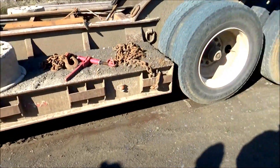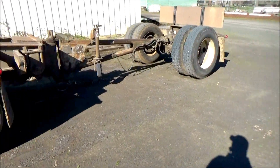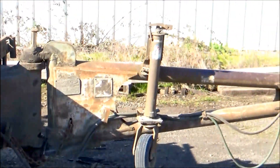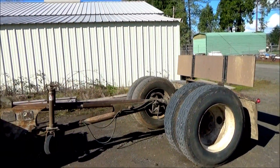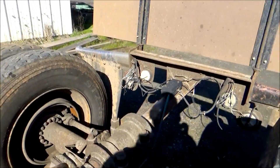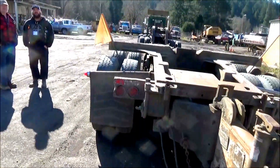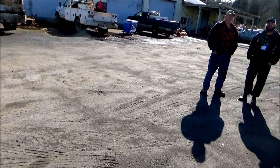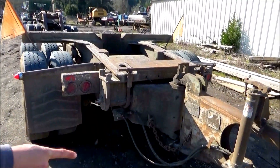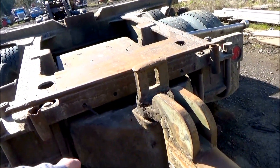It's pretty high right now. That's a pup — the more tires on the ground, the heavier the weight you can haul. Some pups have dual or triple axles. You don't want to get this thing in a situation where you have to push it, because you're fighting the steer tires going up a steep mountainside. At that point you drop this off, or pick it up and swing it to the side and tie it off, then pull and push in the middle.